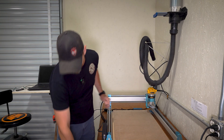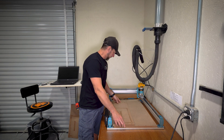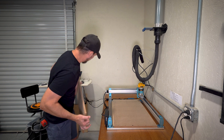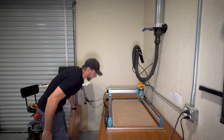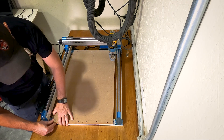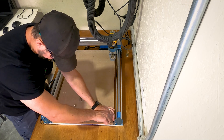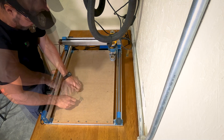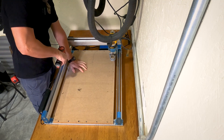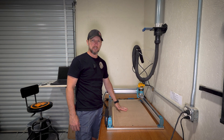From there I needed to replace the base plate. The original base plate is now too short because it's the same length as the original y-axis. So what I did was lay down a base of three-quarter inch plywood, screwed that to the table, and then put three-quarter inch MDF over top of that. It's bolted to the machine at the ends, and I went over on the edges and just tacked a couple screws in to make sure it couldn't move.